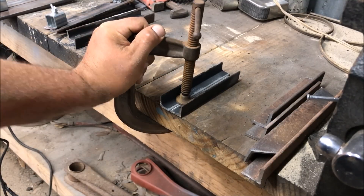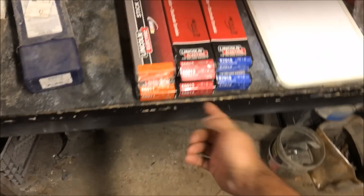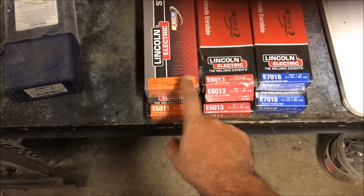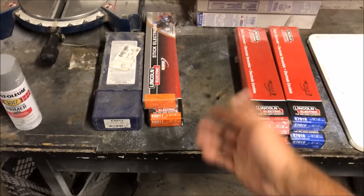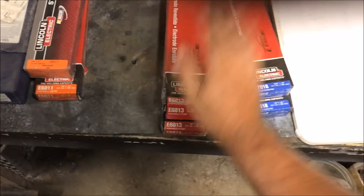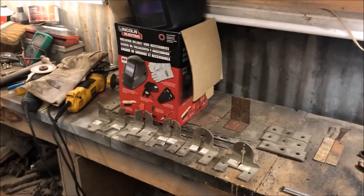When I talk about amps, that's all we're doing — just switching the dial. I wish somebody would have told me to go to Home Depot and buy every type of rod they have. They basically just carry 3/32 and 1/8 inch in 6011, 6013, and 7018 — that's the starter stuff. I personally hate 6011; my favorite rod so far is a 6013. Pretty much if you can afford them all, buy them all, because every rod is kind of like a magic wand that does a different spell on welding metal.